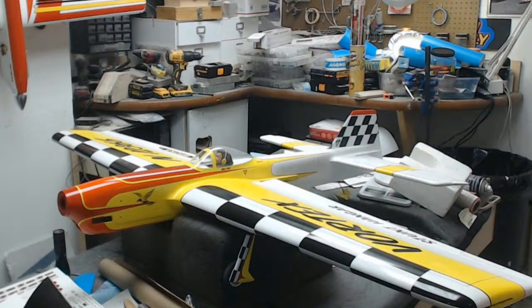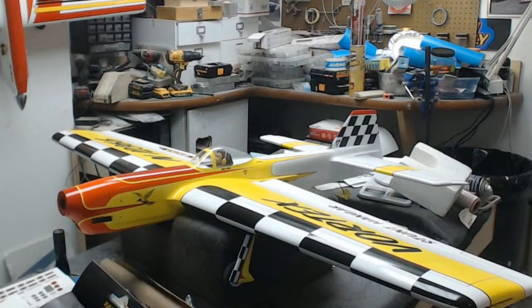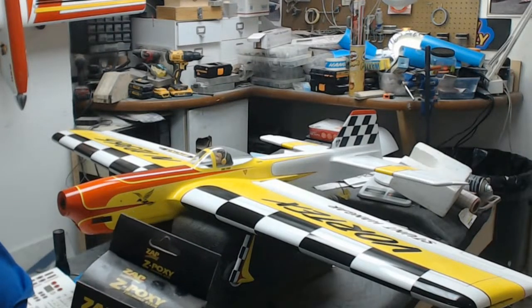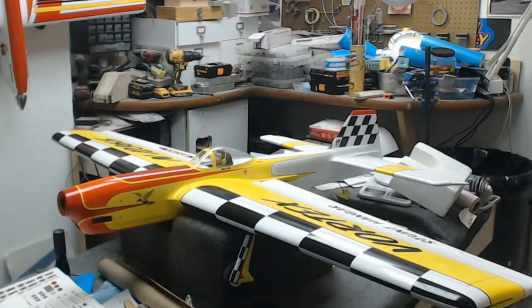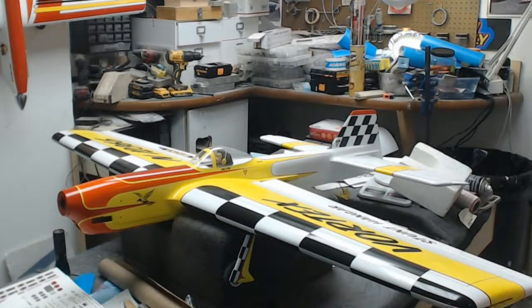And you put it on, and you take a credit card, and you only mix an ounce of this. It only takes an ounce to do it. You put it on, and you squeegee it around the balsa wood. And after you get it all squeegeed off, then take a paper towel and suck it all up. Now you'll think, well, that'll never stick. It will look like there's no glue on there. But after you put your skins in the cradle and your core and then your skin again and then the cradle and weight it and let it dry overnight, you cannot get that skin off the foam. So don't be afraid. You want to use the least amount of glue you can.